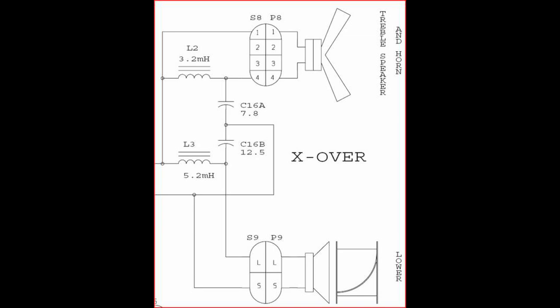Here is the circuit diagram. As you can see, the crossover network is quite simple. All it does is separate out the bass and the treble at a crossover point of 800 cycles. Even though the original capacitor package had drifted considerably, the Leslie still sounded good, but the distortion was more noticeable as bass was being allowed through to the treble speaker.